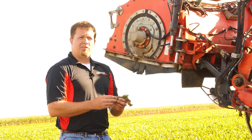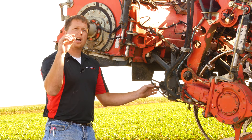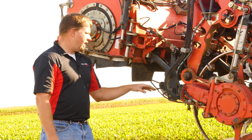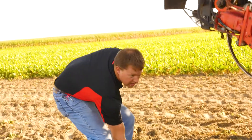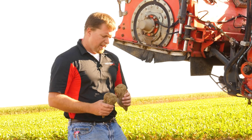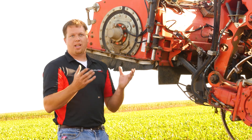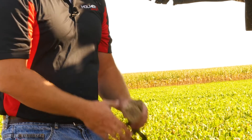You can leave a little bit more petiole, but then it gets harder to scalp. After it comes out of the flail, we come up to the scalper. We have several different adjustments on the scalper. Rough adjustment is done with a couple of bolts to set the comb height in relation to the scalper knife. Fine adjustment can be done from the cabin seat while you're harvesting, and it will adjust the scalp thickness. An ideal scalp on a small beet would be around silver dollar size. Even on a large beet that can be adequate, except larger beets get more petioles out the side and you may need a scalp up to two inches in diameter to get all the petiole off the top.